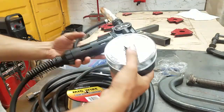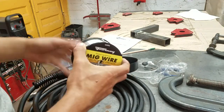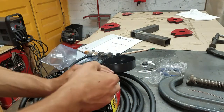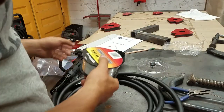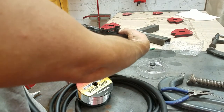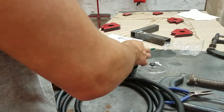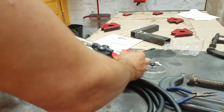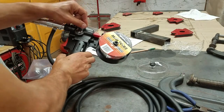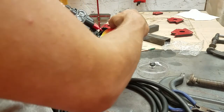To load it in, we're going to open this and take this corner — you can even feel how much softer this is than the steel wire, it's very soft. I'm just going to use pliers to snip off the end. To load the aluminum on here, we first want to make sure the top nut is loose. This is pushing down on a metal sleeve, which is squeezing the rubber, and that's what's going to hold the aluminum spool at the right tension. We need to make sure it's loose, slide this down, and start by taking the aluminum off here. We just want it to have a slight tension, then increase that by tightening down.